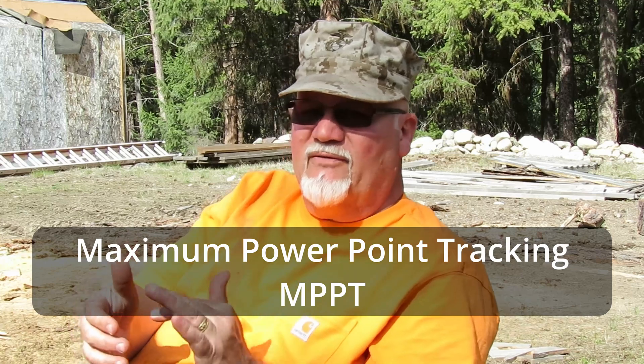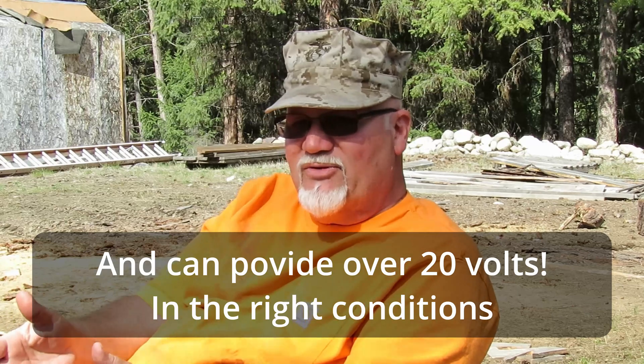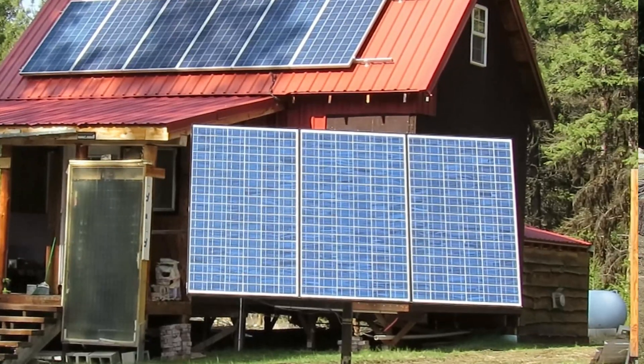I get asked a lot: can I use a 12-volt panel to charge a 24-volt battery bank, or 24-volt panels to charge a 12-volt? You can, if you have a maximum power point tracking controller — often referred to as an MPPT charge controller — and you run them in series. With three 12-volt panels, you'd think that's 36 volts, but it's really not, because 12-volt panels actually run over 18 volts. 12-volt panels need to run high enough voltage to charge 12-volt batteries — you can't charge a 12-volt battery with a panel running only 12 volts. You really need at least 14.9 volts. These panels are rated at 18.2 volts and 11.27 amps.